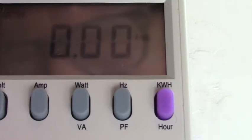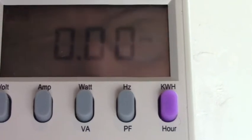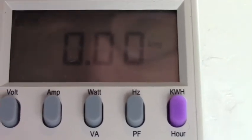That's why people blow the circuits most often when they first turn on a bigger electric appliance. Like when you first turn on your microwave, boom, if it's on a circuit with something else, the circuit's going to blow right there at startup. See, the startup amperage usage is a little higher. This blender uses about 3.8 amps.